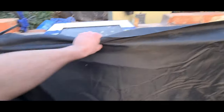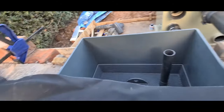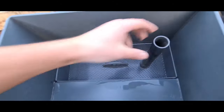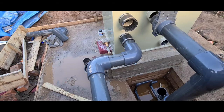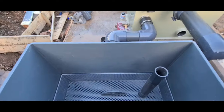The skimmer's not glued on yet, but that can be done easy enough. We've got the built-in overflow as well. So there's the skimmer — you've got your one inch overflow pipe there, you can set it to whatever height you want. A four inch pipe going down there, through that gate valve into the bottom one over there. Nice and easy to use.